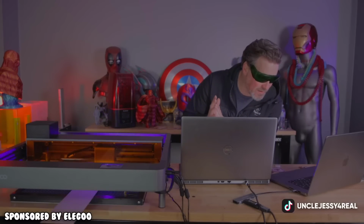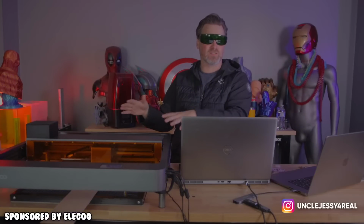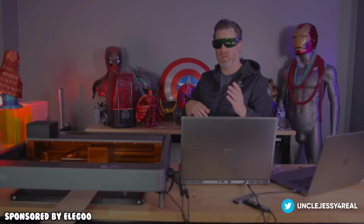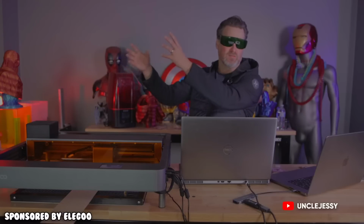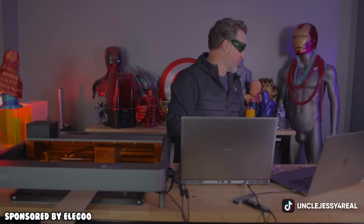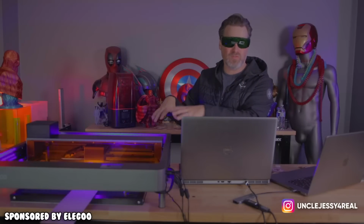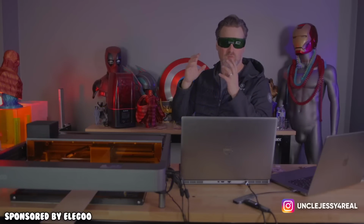Yes, Jamie, hi. Just saw your message there. Yes, safety when working with laser engravers is absolutely critical. There are acrylic panels on here to help protect from some of the laser offshoots that are happening, and there is a little bit of an air filtration system that Elegoo has built into the top to help mitigate some of the fumes coming off whatever you're engraving or cutting out. However, you definitely want to make sure you're wearing these fancy spectacles. I don't want to have cataract surgery from the laser engraver. The glasses come with the units themselves, so you want to make sure you're wearing something like this or these or other variations to protect your eyes.